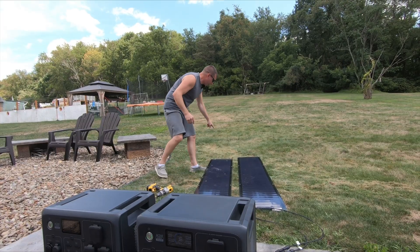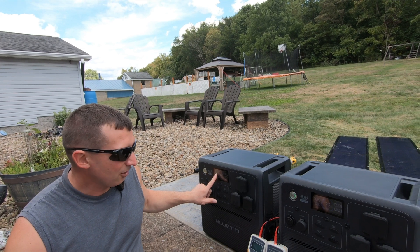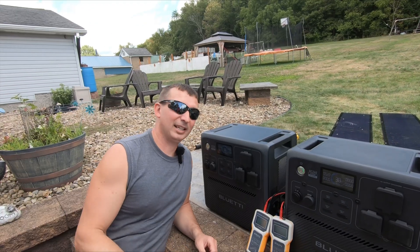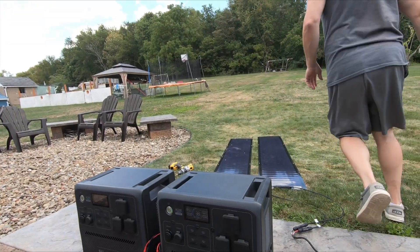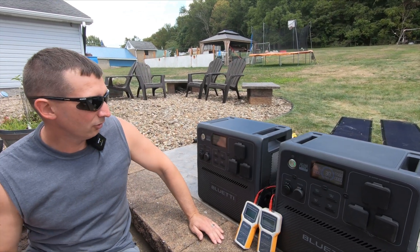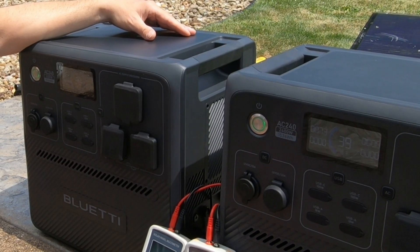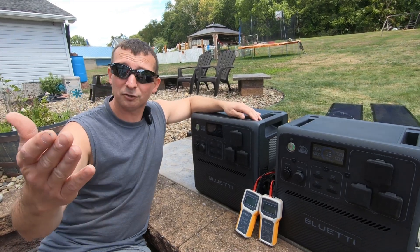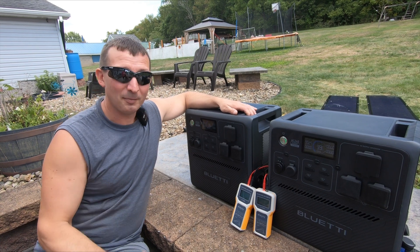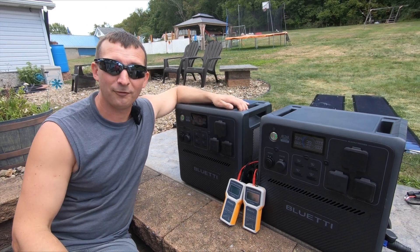With seven holes behind a cloud it's 19 on the drilled panel and 22 on the clean one — a three watt difference. In full sun it was 20 to 21 watts on the seven-hole panel versus 24 to 26 on the clean one. Still not a huge difference. I actually enjoy this test — if any other solar panel company wants to send me similar panels to drill holes in and put through a beating, I'd love that. Let's see what they do with full sun when it comes back out.